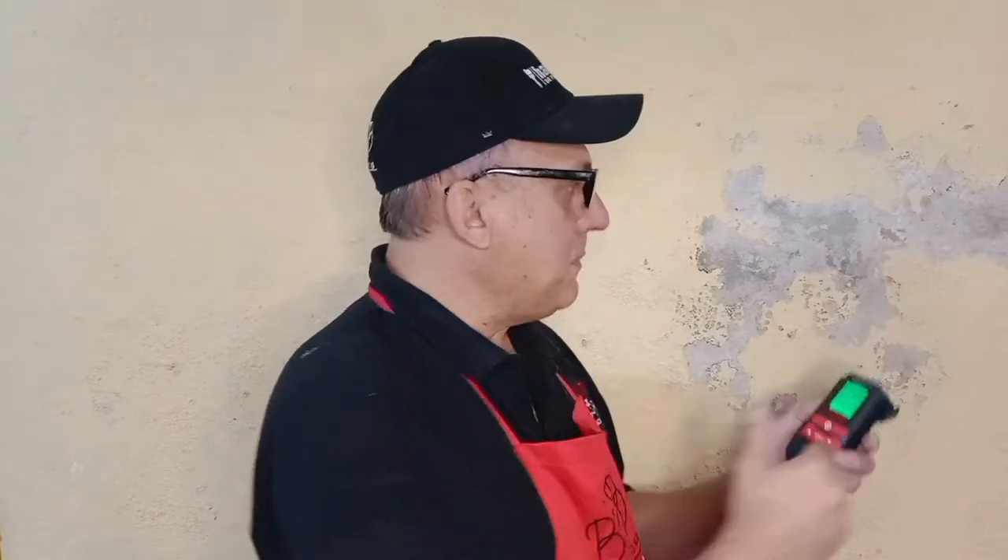That beeping means in this area it's reasonably still dampish. I'm getting a moisture percentage of around 20%. To paint or prime a wall, your moisture reading should be below 12%. So put a fan on it if you have to, dry out that area, and investigate where the problem is coming from.